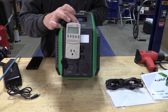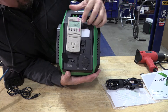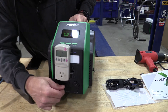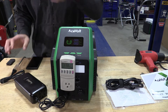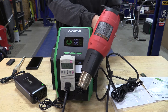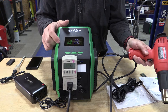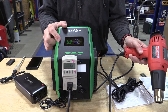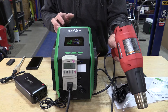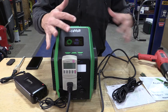If we plug the kilowatt meter in and turn on the AC, it shows 112 volts — not bad. You can also plug in the charger at the same time; the input and output doesn't change. Plugging in the Milwaukee heat gun on medium, that takes us right to the max — around 720 watts at the wall, and we're showing 679 watts output on the unit. Very reasonable, fairly close. On high it goes upward of 1,400 watts and this thing kicks off immediately. That's awesome because we don't see that voltage drop — it cuts off fast, which protects any sensitive electronics connected.